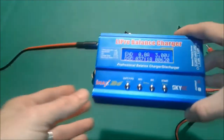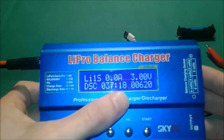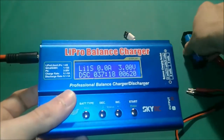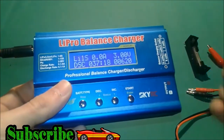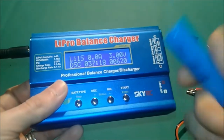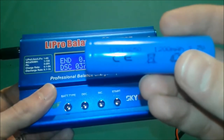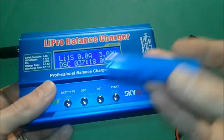The discharging process is done. As you can see in the image, it took 37 minutes and 18 seconds to discharge this battery at 1 amp, and it accumulated 620 milliamp hours. We could go lower than 3 volts — to 2.5, let's say — but it's not recommended. In an ideal scenario, charge it to 4.1 volts and discharge to 3 volts for longer cell life. As you can see on the battery label, it says lithium-ion and 1200 milliamp hours — so from 1200 down to 620 is a long way.